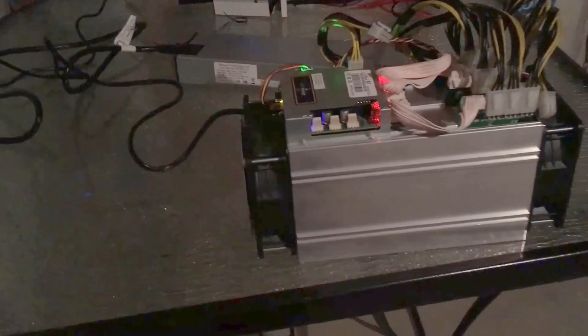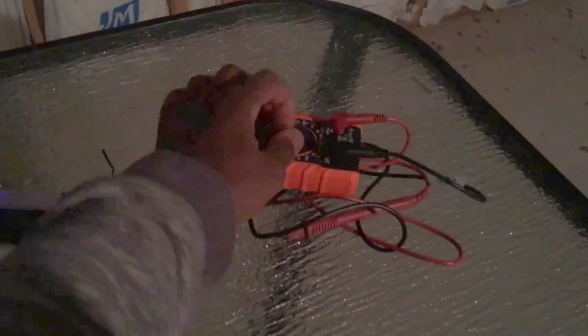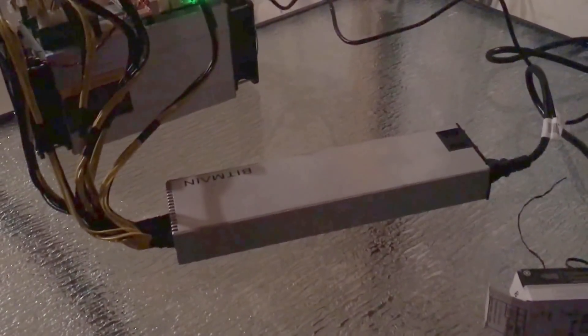I really wonder if the Ant Miner is going to be as loud as the PSU, which I doubt. It's definitely running and getting even hotter. I have an ambient temperature gauge upstairs but not down here yet — I'll put it up to see how hot it gets. This is just a voltage checker to confirm the voltage. I checked the previous outlet he put in and it was 120. This one was 240-plus volts when he installed it. This outlet is rated 250 max, Ant Miner 250 max voltage, minimum 205 volts to run this beast. If no lights come on, you do not have enough voltage.